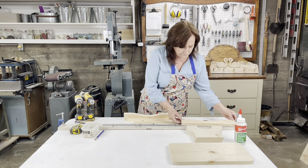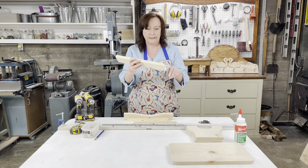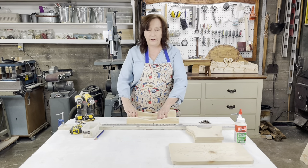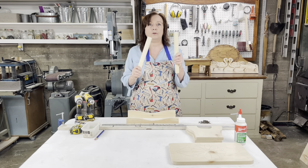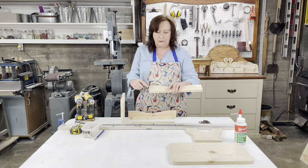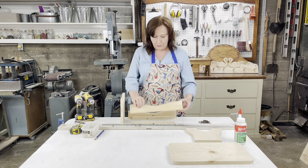This is the front part — it's 14 and a half inches. I cut two of these and put a little curve because I thought it looked good. You could put it straight if you want. To make the bench I also have two pieces of scrap wood a little bit shorter than this — these are going to hold the top on later. I'm going to place this here and put the screws — two screws in each one with glue — and that's going to make it nice and sturdy.